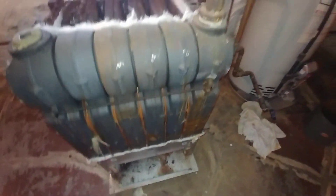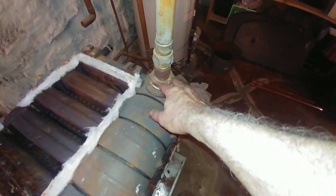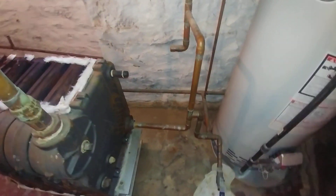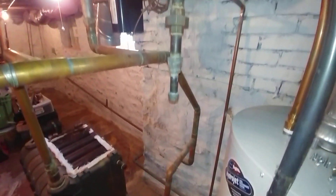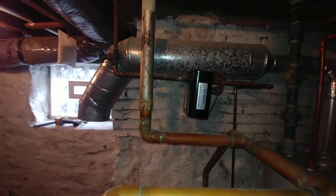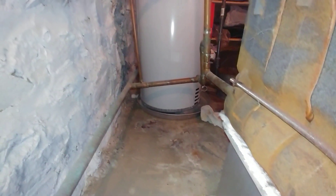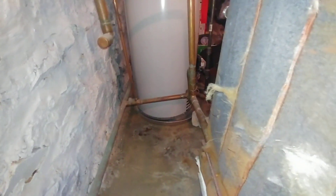There's the firebox where the burners were. What they did was hook this up with a two-inch outlet and bushed it down to an inch and a quarter. You can see a better view of the near-boiler piping — there's your feeder going in, the unimatch with no manual bypass of course. You can also see that the drain on the wet return is pitching backwards — minor errors.